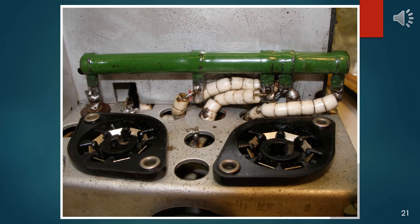This large wire-wound resistor value is dependent on the mains voltages available to power the set. Little cup ceramic beads are strung on wires passing from the hot resistor, a highly effective way to ensure that the installation will never char and short through to the chassis.